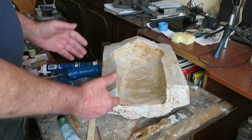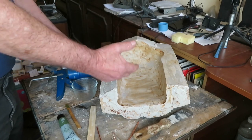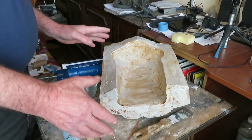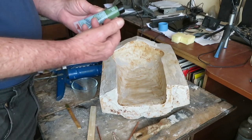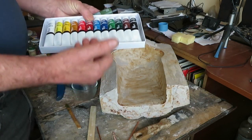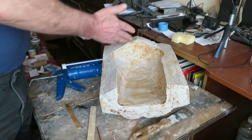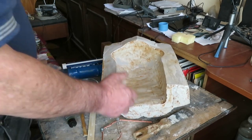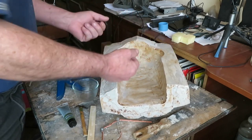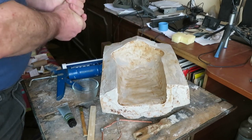I truly don't know — we will have to check that out in practice, because this silicone is not cheap and the quantity required to make a mask or puppet this size adds up. There are parts of the design where the colour is not green but brown or yellow, and for that we will use other acrylic paints. Each colour has to be mixed separately and you have to define that before you start. We will begin by placing Vaseline all over the surface of the plaster in order to help taking out the silicone after — the plaster tends to suck the Vaseline so you should apply several coats.